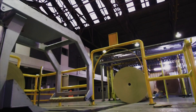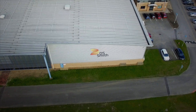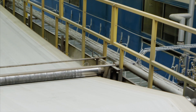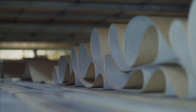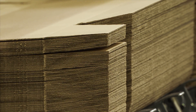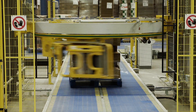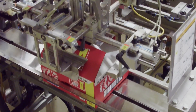The reels are cut down and shipped to our packaging plants. Paper feeds into the corrugator, a machine that makes cardboard by fusing layers of paper together. The new cardboard sheets are stamped with cuts and fold lines and printed with the branding and product information. They are transported flat-packed to our customers' factory where they are popped into shape and products are placed inside.